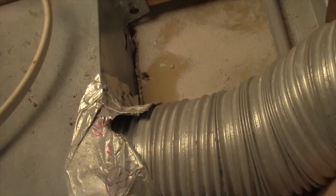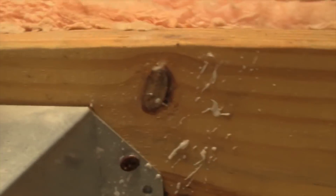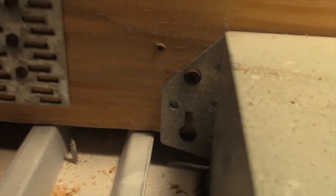Once you're up in the attic, be careful where you're walking — make sure you're walking on the beams, don't walk on the drywall or you're gonna fall through the ceiling. At this point you're also going to be looking for the vent, and if you have any idea where it is you're just gonna walk in that direction. Find it, sit down and get comfortable, because you have some work to do. You're gonna have to find the screws and disconnect the vent from the beam.